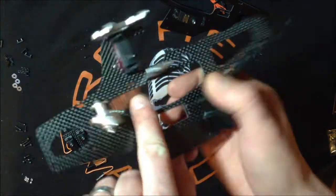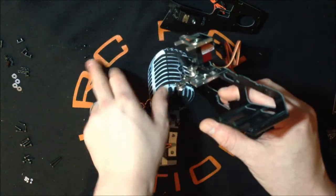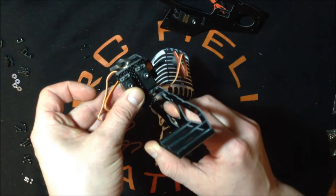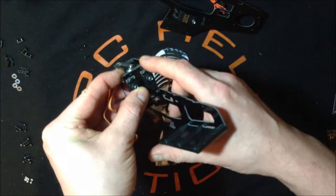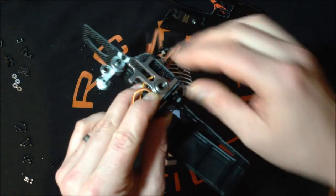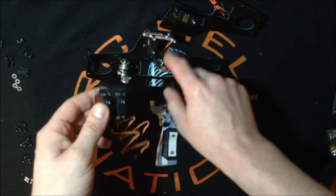You have these screws here. You might notice they're not on the other side, so make sure that those little holes for those screws are facing forward. For the next step, we're going to use these four remaining screws that we have in that hardware, and we're going to put these servos here. So we're going to line up those holes on the carbon fiber plate with those holes on these mounts, and then screw those together. And again, I'm not going to over tighten them. We'll have the main shaft through everything when we get everything nice and tight. So we'll show you that when it's all ready to go, and then probably time to put the main shaft on and then get everything tightened up and move on to the step after that. So we'll be right back to show you this guy mounted on this side of the frame.